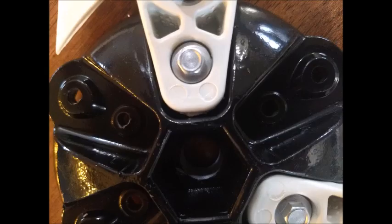The slots for the blades are snug but not so tight as to prevent you from adjusting the spread. The casing is a clamshell assembly with the stator sandwiched between the body and the front cap. The opening is sealed with a large o-ring, but there is no groove for this o-ring and it rests against the bolts in places. I do not believe this will allow an adequate seal in very wet conditions. There is also only one bearing assembly in the nose, and it is unsupported in the rear rotor.